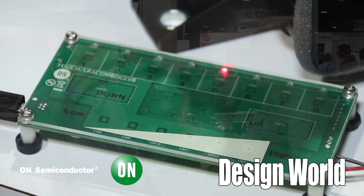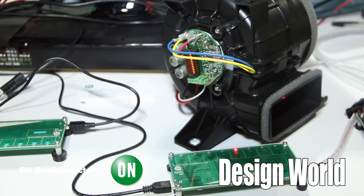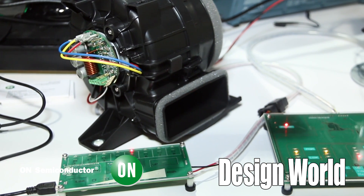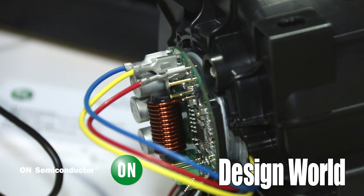There are a few other components on the demo board. Can you tell us what else you need to add to that chip to get a complete motor drive circuit? Obviously you need some power regulation, because it's not going to have full power regulation to work off the automotive range of 8 to 42 volts. So there is some regulation on that board. Also, the chip doesn't have the drivers, so on the board you've got some MOSFETs, and their size depends on the size of the motor.